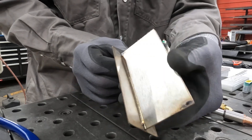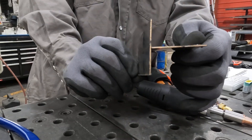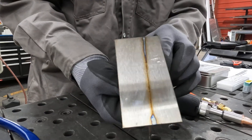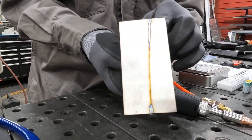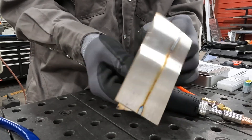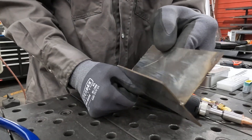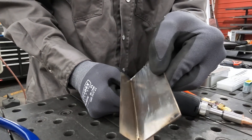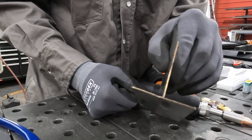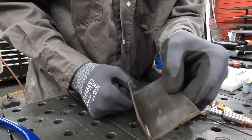Virtually no distortion. A little bit of coloring on the bottom, so you can clearly see it made it through — but it didn't blow through, didn't make a mess, and it's just super simple. To tack weld that by hand is going to be a chore, as we all know, so this is a real time saver for thin stuff like this.